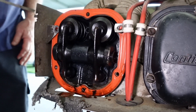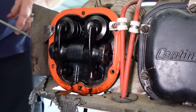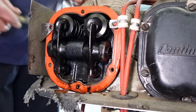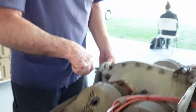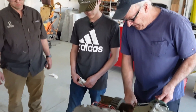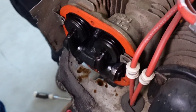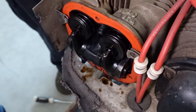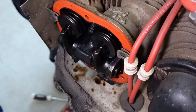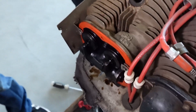You can tell how they're running. This is the exhaust port here. So it's a four-stroke engine — you all know about that. The intake is opening and the valves kind of overlap. Right when they change like that, it's top dead center on the non-compression stroke. So right now the intake valve will open — see there, so the piston's going down and this valve's opening, so it's sucking air in.